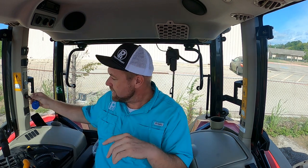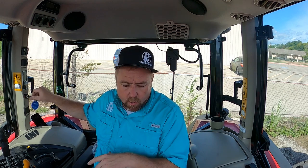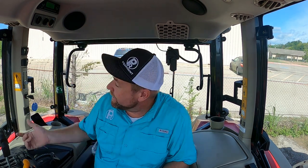I'm going to do it real fast while I'm sweating in here. So key on, clutch pedal down. I'm going to pull up on the shuttle lever. It's going to beep and I'm going to let up really slowly. So it's going to stop and I'm going to keep letting up, real slowly, real slowly, until it, dang, failed. That's the trick to this thing that I've noticed, is you've got to be super slow letting that clutch up. So I'm going to shut it off.